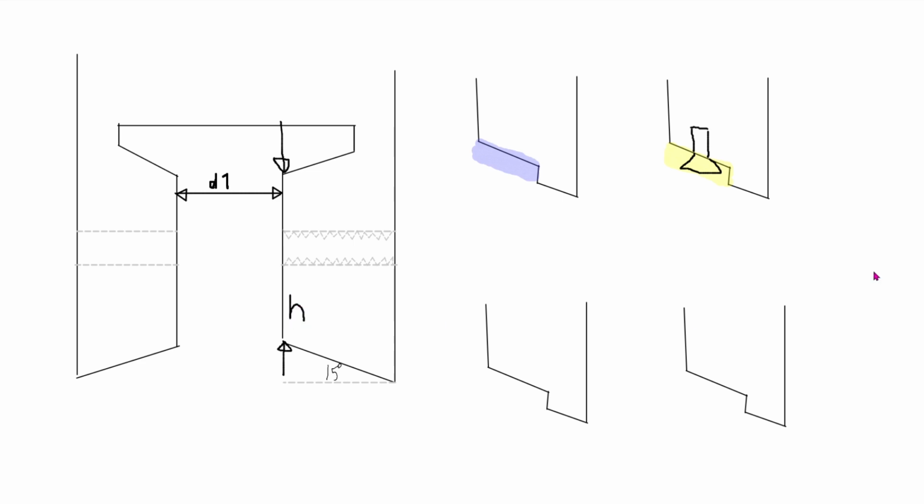So once you have the height, you can build up the worn down part. You weld this up and you weld this up, and then you add some more over here so it looks good. If you just weld up the inner part, you have a step here, and you don't want that. You can do that. And if you want to do a shim, if you have a mill, you could machine it down like so, and then put a shim on of the correct thickness, and then machine it down and bolt it on again. You could braze it on, but let's bolt it on.